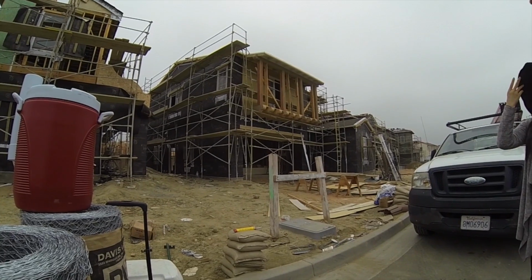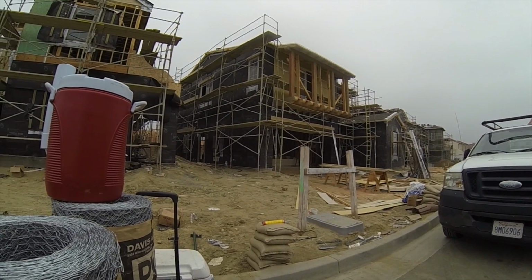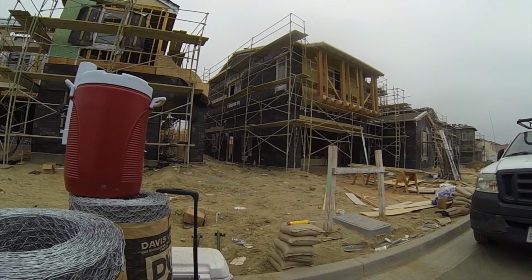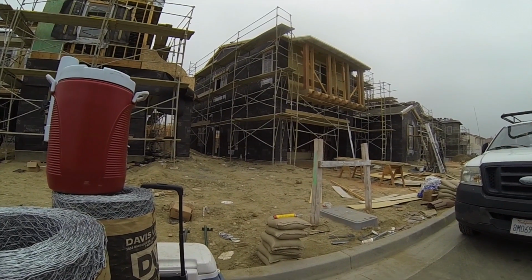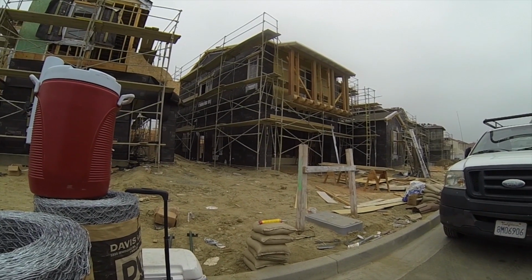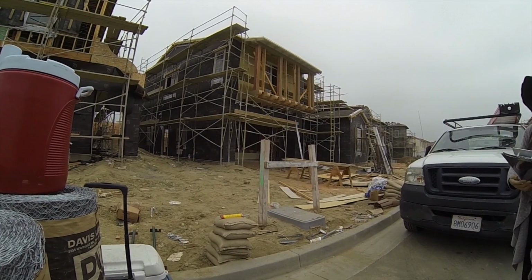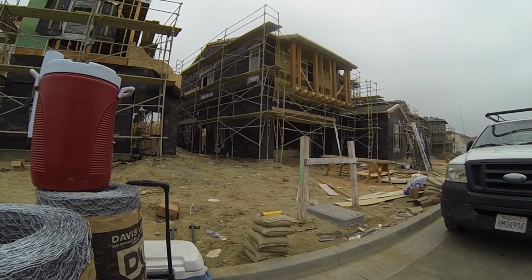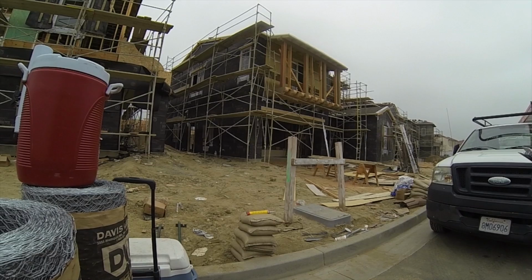Okay, that's called a screed. Anytime you have any kind of flat work, you want to be 2 inches below that. And if you have some kind of softscape, grass, bushes, planters, you want to be 4 inches below that. So if you bring out a landscaper, and they don't even follow that simple rule, fire them on the spot because they don't know what they're doing. Those are always important rules to follow.